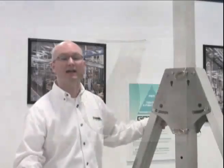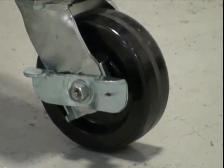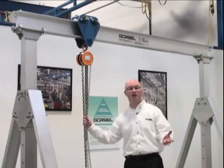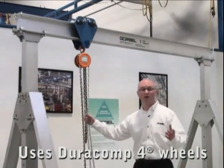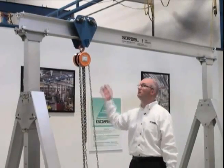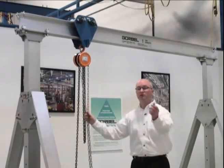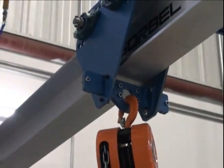We also have locking casters on the bottom. Since this crane won't always be used on a perfectly flat surface, the casters lock so they stay in place with no drifting when the crane is in use. We've also designed a trolley specifically for this gantry crane — it's included in the price, unlike our competitors. The top-running trolley runs very smoothly using the same wheels as our workstation cranes, making it very easy to move with very low rolling resistance. The top-running design allows the beam to be smaller and lighter by using its full strength, making it easier to assemble, store, and move. It has an eye on the bottom so any chain fall or hoist can be quickly and easily attached.